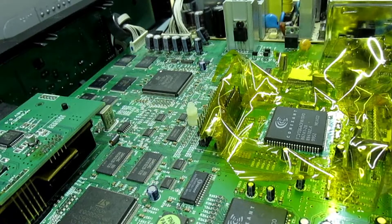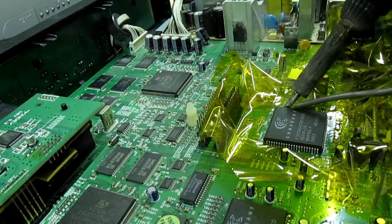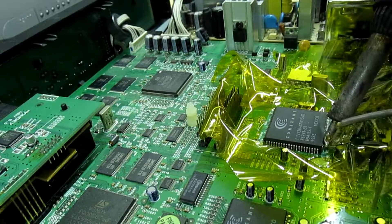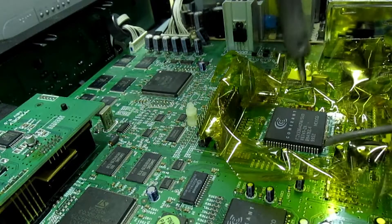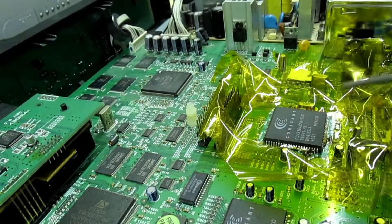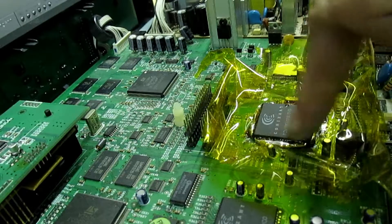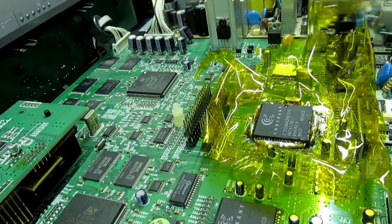So here we go again - I'll give you the general idea. Take the solder and run a bead of solder around all 84 pins. You can see why the surface mount solder is no good, because you'd use far too much of it.